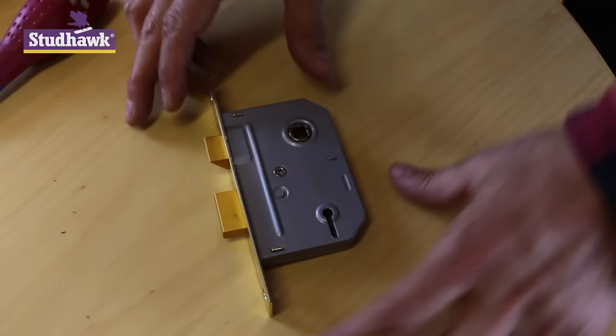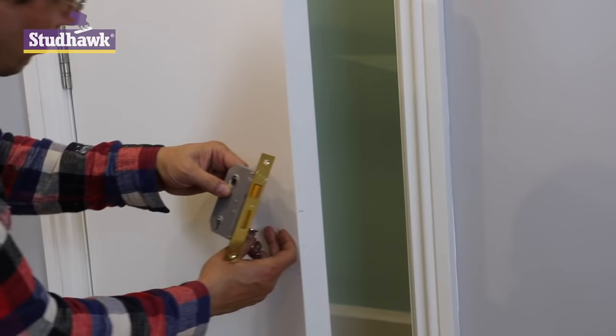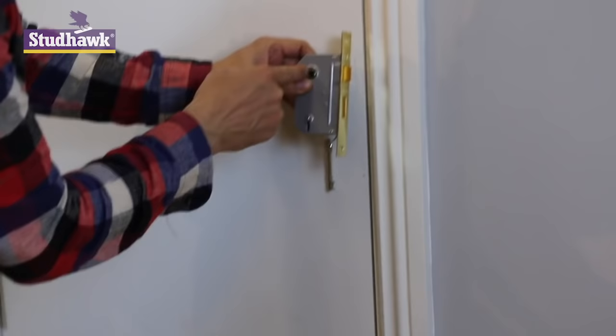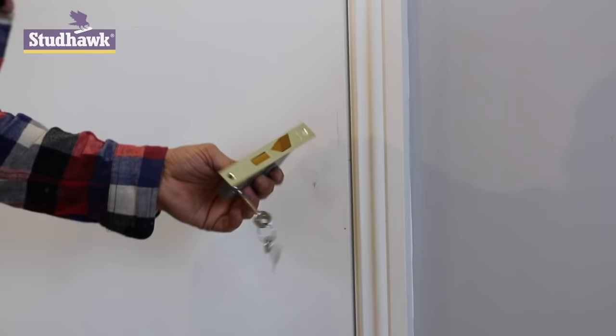Now you need to know how to put your handles on. That's what we're going to do in this video. So here's our lock and handset, latch set. The latch needs to reverse. An important consideration when choosing your lock is to get the right distance from the centre of the spindle and the centre of the keyhole to the edge of the door plate. Locks vary in sizes of throw for different sizes and styles of doors, or French doors if you like.